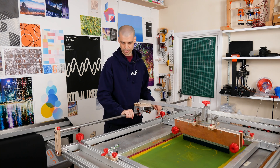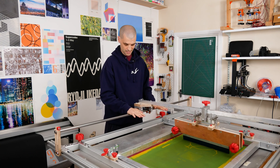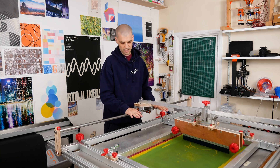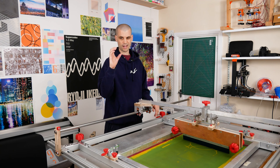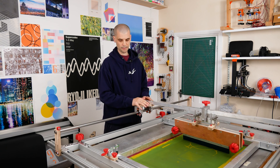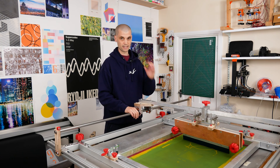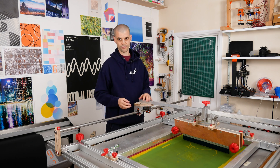I didn't want to buy a thicker tube because this cost me enough — I think it was about 20 pounds. This is 20mm thick steel rod and even this will kind of bend in the middle. You can get really nice thick 50mm scaffolding poles, which is typically what you'd see in a build like this and they're obviously much sturdier. The reason I didn't do that originally is because it's very hard to find linear blocks in the exact diameter for the tubes you can get. Obviously if you're making your own, you can just build whatever diameter you need.